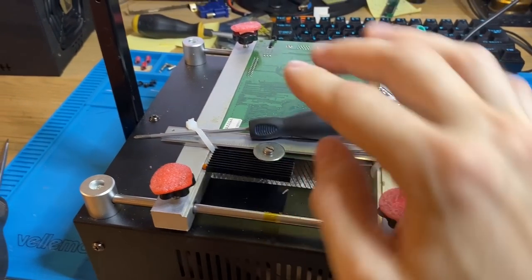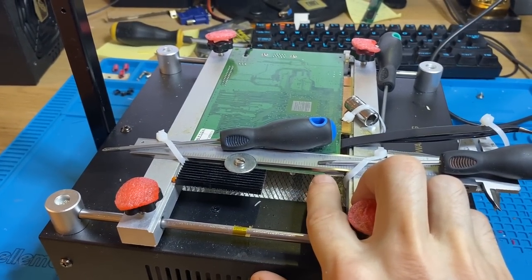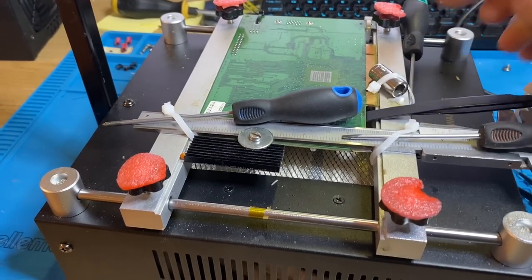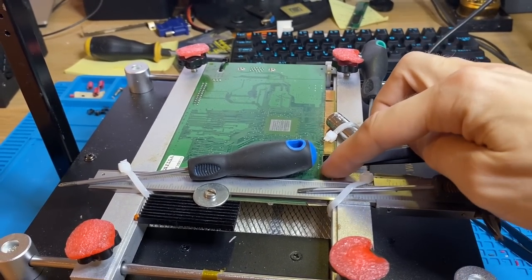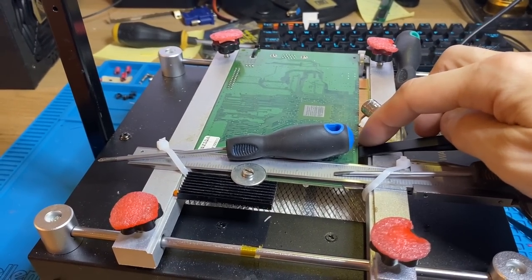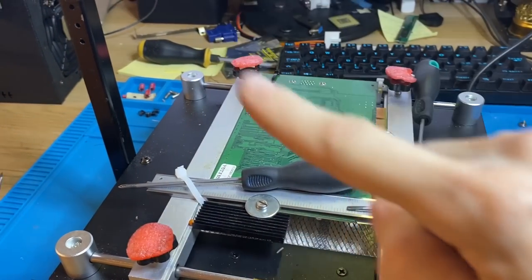So basically if I take this out and this method works, I still expect the card to bend back a little bit. So that's like a half to a millimeter, whatever the thickness is. The blade is probably just under a millimeter. So that's there. This one here is, well, one of those. It's because of the same reason, the bend starts around here. So we have this contraption here just to hold the card down. Because if I put pressure underneath here, the PCI slot, my edge connector, will pop up a bit here. So the bend starts here. So this holds that in place. That unbends, it goes like that then, so that pushes up and takes out the bend, so hopefully it's straight.